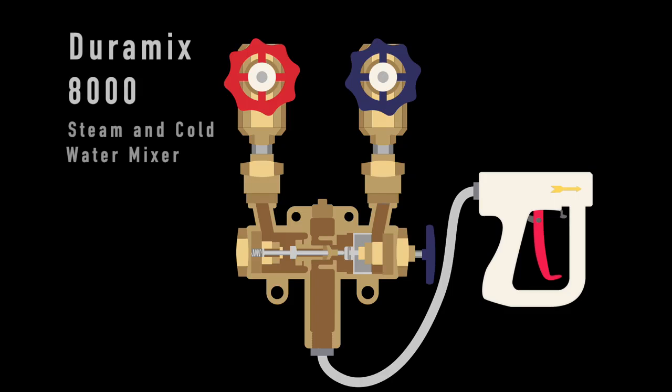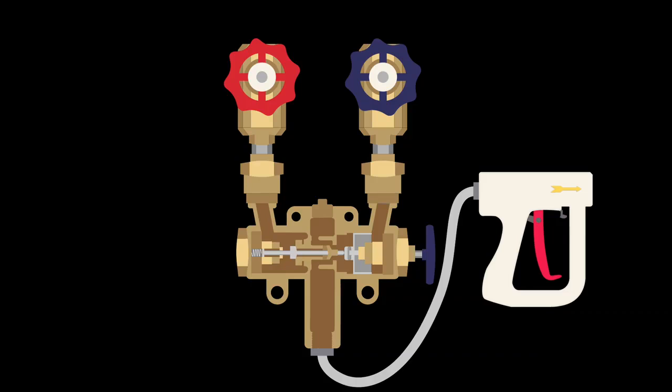Welcome to the Duramix 8000, SuperKlean's premier steam and cold water mixing station. This unit operates with as little as 30 psi water and steam pressure, all the way up to 150 psi, giving users a high degree of flexibility to meet all of their washdown needs. We hope this animation helps you better understand the mechanisms that make this one of the most reliable mixers on